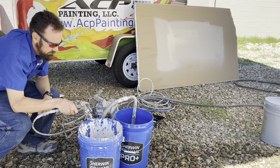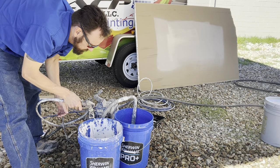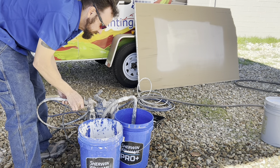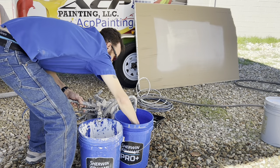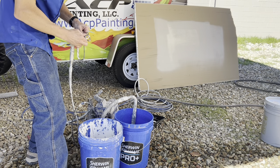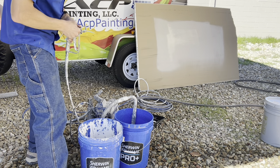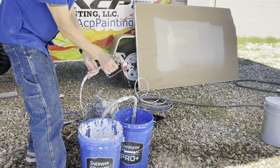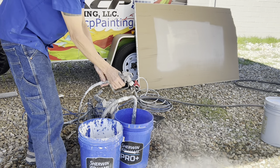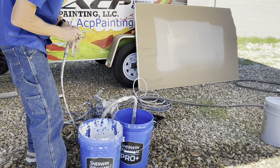Always be mindful of your area where you're cleaning out, so you're not getting paint water or potentially spattering anything where it shouldn't be. Now that we've got fresh clean water coming through the unit, I'm going to stick the spray tip back in and flush through some clean water. Start with it reversed, then switch it around and spray normal a few times. You don't want to overdo it because that'll wear out the tip quicker by spraying too much water through it — it's not necessary.